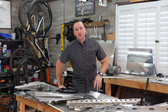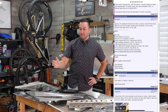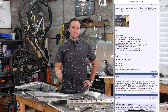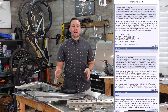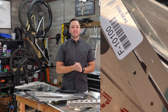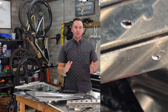If you follow the forums online, there's been an active thread where people have been talking about these laser cut parts. These laser cut parts are having issues with cracking occurring, whether that crack occurs during the dimpling process or during the riveting process. Either way, these laser cut parts made in 2022 were provided by a vendor who allowed for sloppy tolerances — whether it's the way they laser cut the hole or whatever. A lot of the parts produced have inconsistencies that are making them much more likely to have cracks than any other parts.